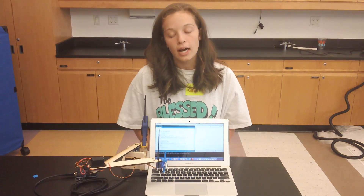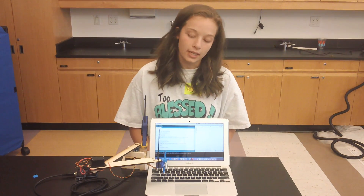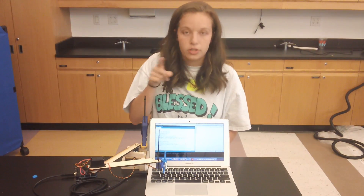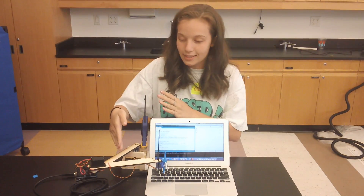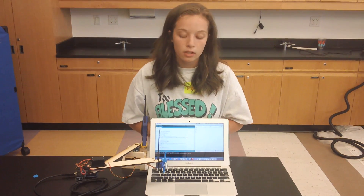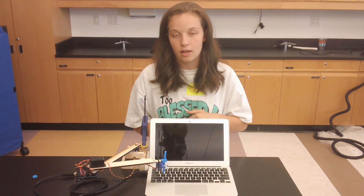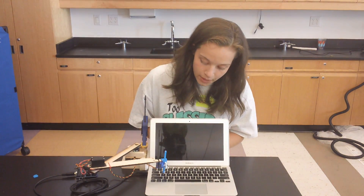Next I had to figure out this finger issue. What the robot is doing is coming from up here and doing a very targeted linear motion. I expected linear motion to be easy — lines are the first thing I learned in math — but in midair, suspended by one thing, linear motion is really difficult. I first tried using the circular motion of the servo to hit the key like a lever, but that didn't have enough force. Then I tried a pulley, but there would be too much inertia. We considered a glue stick linear actuator, but then we got a rack and pinion and that seemed a lot more reliable, and it's working super well.